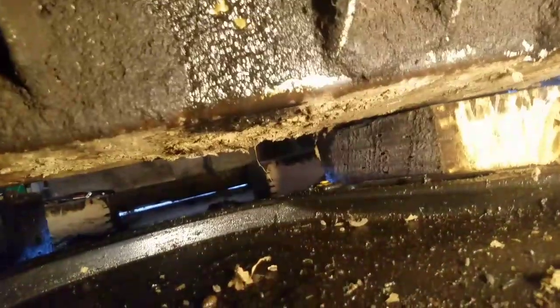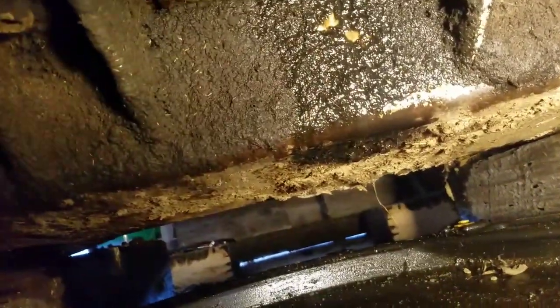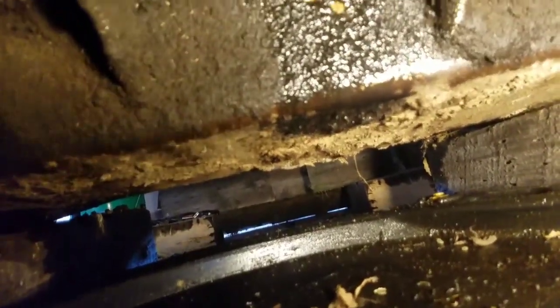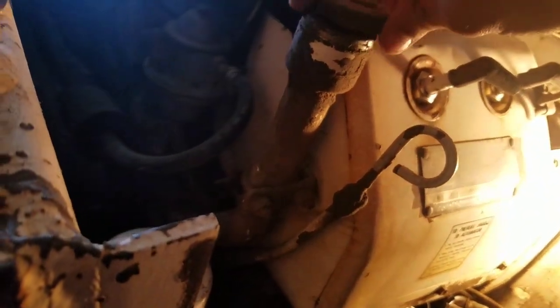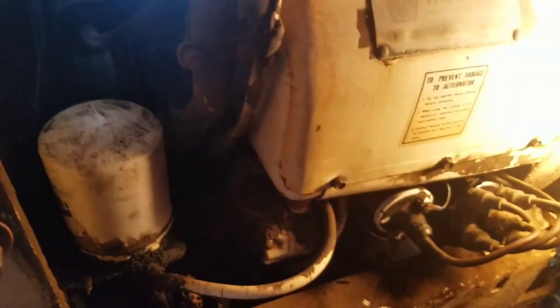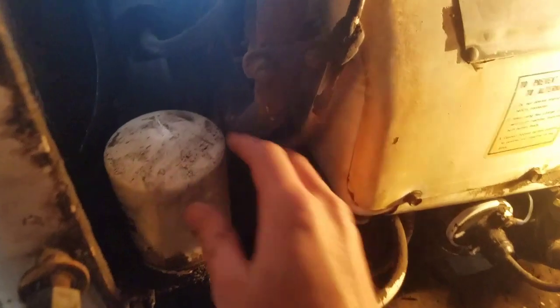And then they have drained the oil. I'm not sure you can see it, but the drain plug goes in there somewhere. There. You put that back in. Get some new oil put in here. These things have just a regular oil fill right there, dipstick there, nice and handy. We've got a new oil filter. Not that one, that's the old one. I stuck it on there while I was blowing off and cleaning everything so crap wouldn't get in there.